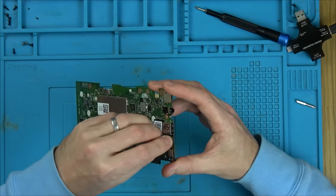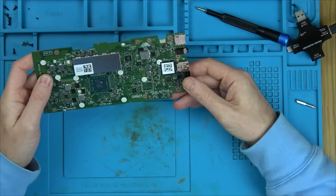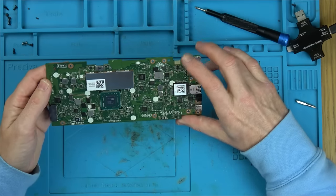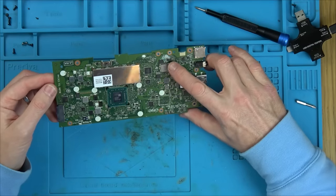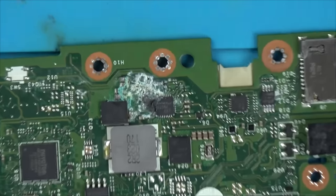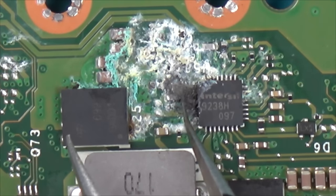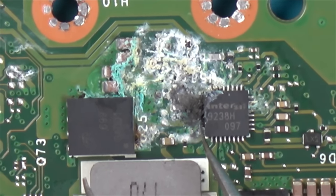Here's the little LED — that should light up. And here we go — look at this, we've got an explosion. It looks pretty nasty. Good news is at least we can see it. That side all looks okay but this is the problem here. Let me zoom right in. Before I do any scraping, we can still make out the chip name. I don't think it's going to be fixable because the pads are probably completely gone, but we won't know until we get the IPA on it. I wonder if it's water damage or if it just exploded.